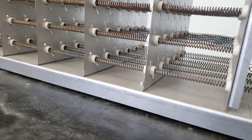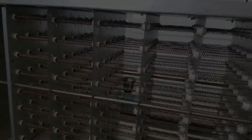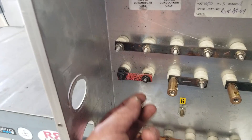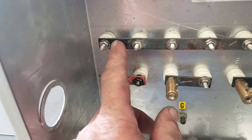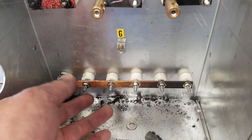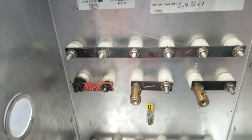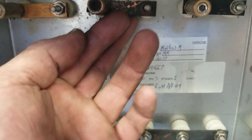We've got a 60,000-watt heating coil here — that's right, 60 kW — a heating module out of a powder coating oven. This thing came in for repair. It's not that old. The customer did not do his maintenance. Electrical maintenance is very important. These are all copper bars and they were all loose. That jumper right there — that was the killer. That's what killed this module.